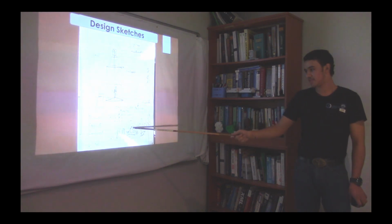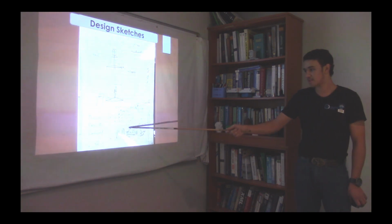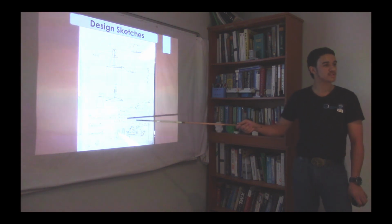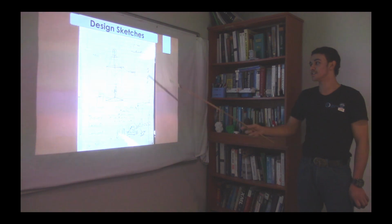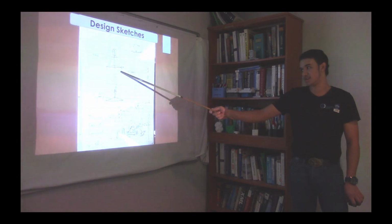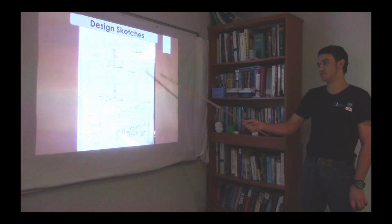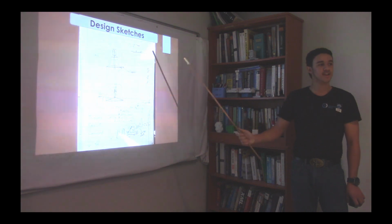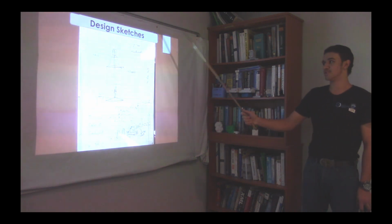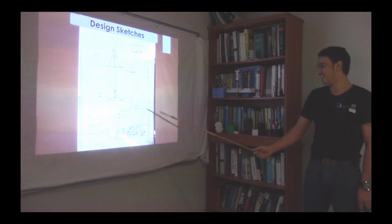Now it's a casing with an impeller in the middle. And then as the water flows through, the impeller turns, and then at the back there's a motor, which also turns and generates electricity that sends the electricity to the laser up on the windmill, and then the laser automatically shines to the home. So if you look to the windmill and the laser is shining, that means water is flowing through the pipes to the tanks. And if it isn't shining and the wind is blowing, then you have a problem.